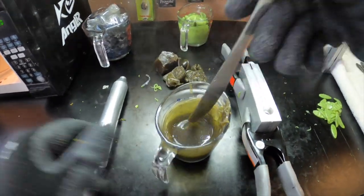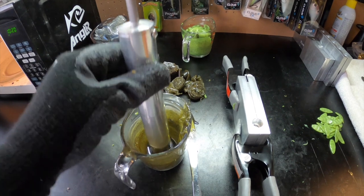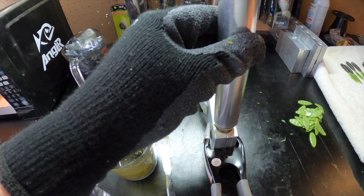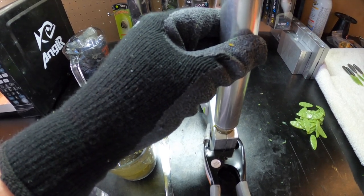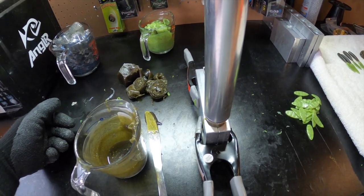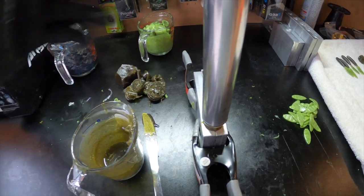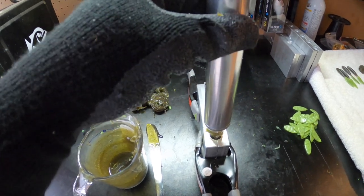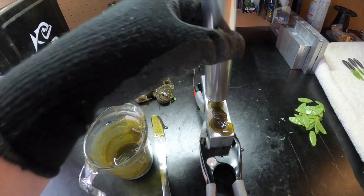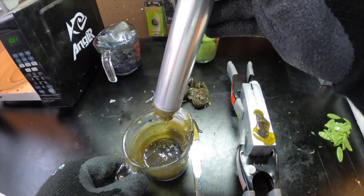Our plastisol is ready to go for another round. Draw the plastic up, over to the mold, even pressure down, holding the pressure. I like to hold it a little bit longer than I normally do just so that body and tail come together — you want a good nice fusion. You don't want any of these tails falling off, and I haven't had any problems like that with other baits I've made with different color tails. Just for good measure, add that extra hold time, a little extra heat, and you should have a good product.